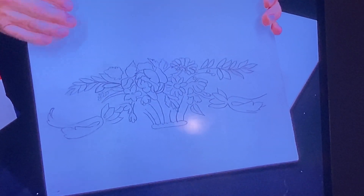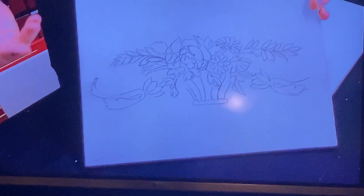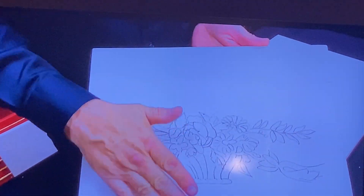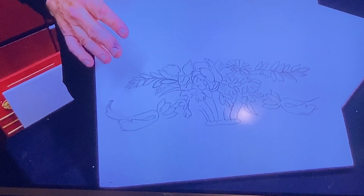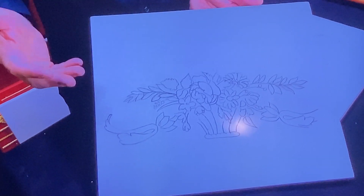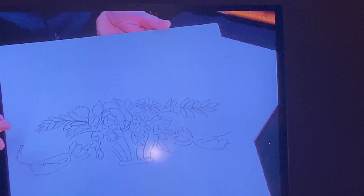Continuing on — I have a gesso board with 21 coats of gesso. This is a great teaching tool. You can see the end of the board where there are 21 coats applied. After every couple of coats, after every night, the next day students have to smooth this down — it becomes like metal. It serves two purposes: learning how to properly coat a gilding surface with gesso and how to smooth it down. Secondly, they draw their proposed carving on it. This is all about gesso recutting using the French recutting tools.